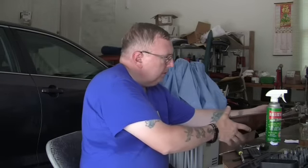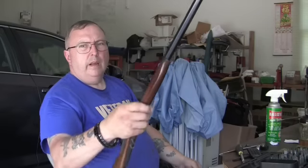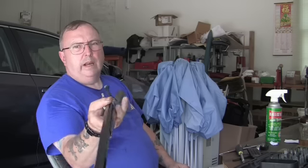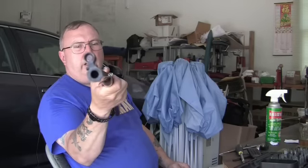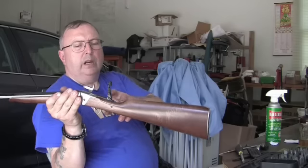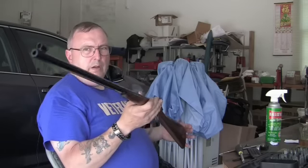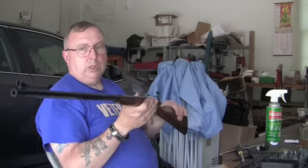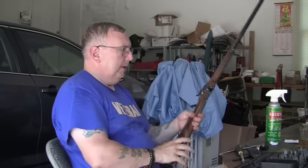All right, my final conclusion on the Sharps rifle. As you can see, we had to offset. I got the breech bolt out, so don't panic. We had to offset that front sight a hell of a lot. I checked the tang sight, there's really no play in the back. So I don't know what the story is there, but at 1,500 yards, once I knocked that thing almost out of the way, it's on center, windage-wise.